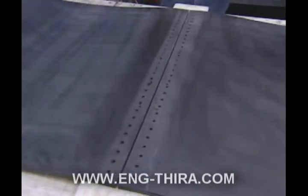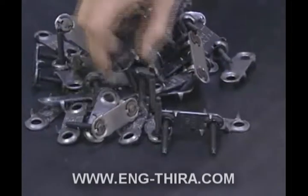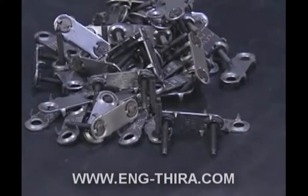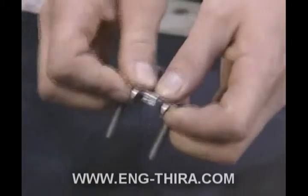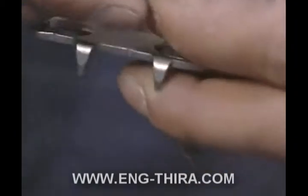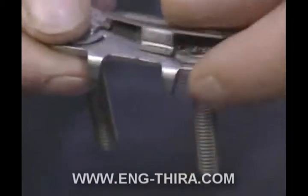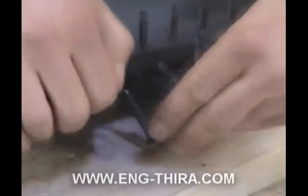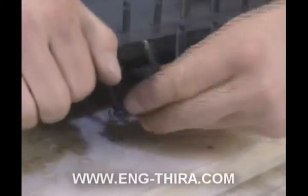You are now ready to begin installing the fastener assembly. Most fastener sizes come pre-assembled in a quick fit configuration, eliminating the need to assemble the bottom plates. However, some bolt solid plate sizes require you to prepare bottom plate assemblies prior to installation. To assemble bottom plates, insert the bolts through the plate, then secure the bolts in place by attaching the clip. Next, fold back one of the belt ends and insert the bolts in one row of holes.